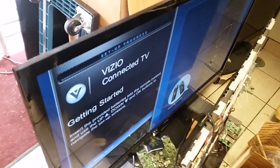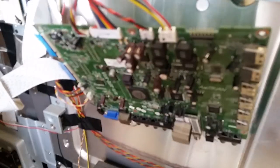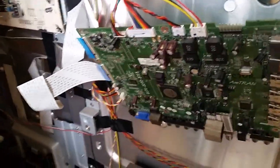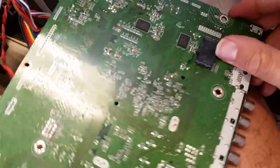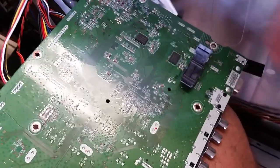If you have an empty EEPROM, it will never show the Vizio screen because that EEPROM contains all the firmware for the Vizio. This one passed through the Vizio screen because it's brand new — it just defaults to the initialization screen. You will not get that with the M550SV main board if there is no EEPROM, if it's soldered badly, or if it doesn't work. Now there are other TVs where the firmware is on a different EEPROM device — like Samsung D-series and E-series — where they would start anyway.